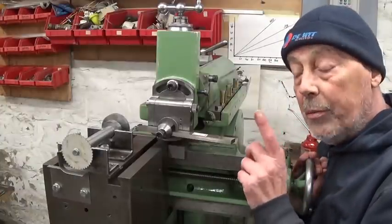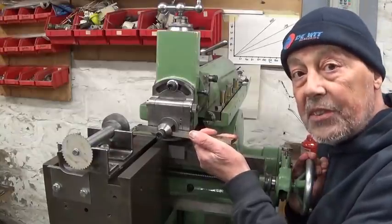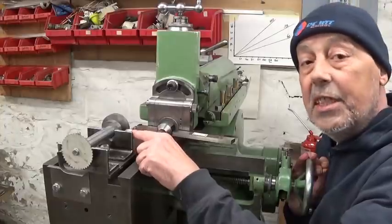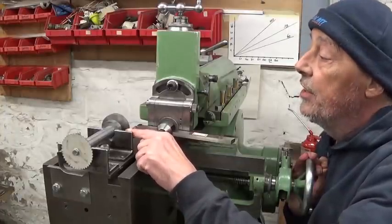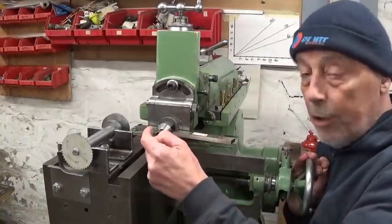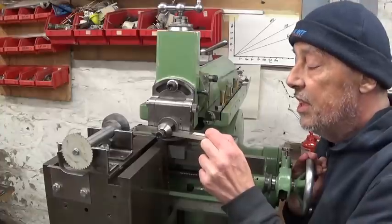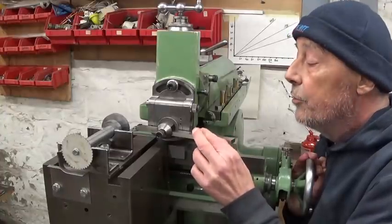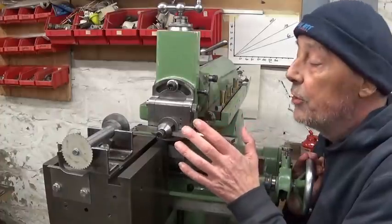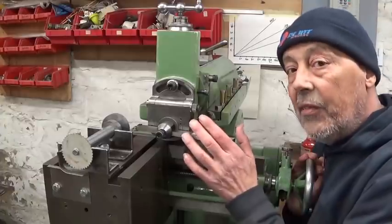Of course, very important in that case, we lock the clapper, because if the clapper lifts, we're gonna have a serious crash here in the gear. Now in this case the tool is gonna rub every time on the backstroke, and I've seen while I was making the tool that this tool steel is a little bit soft, so it will wear out a little bit too quickly.